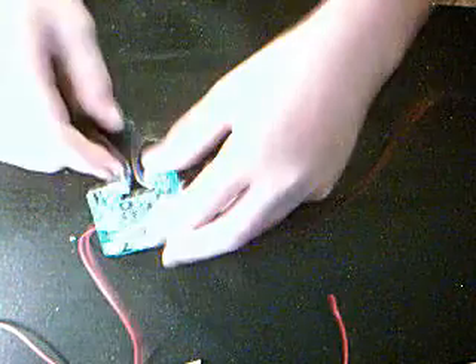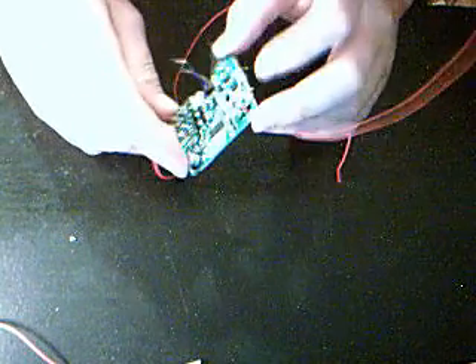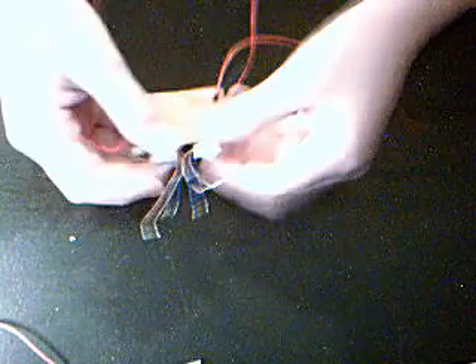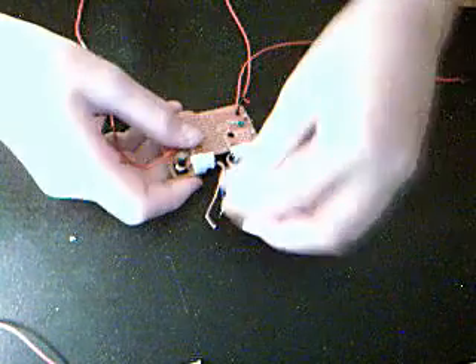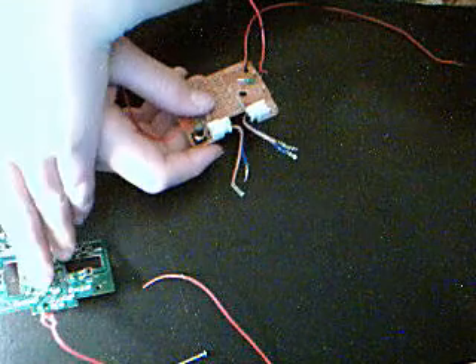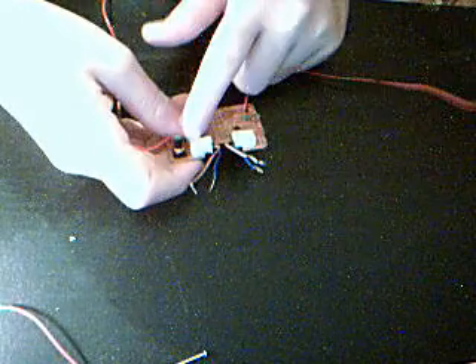This is the receiver right here — a simple board. It's got an H-bridge, some transistors, all kinds of circuitry. Here I've got my power connections right here. Now you'll find your leads here, and these leads go to the motor. If you want to have those independent switches control four relays off of these two signals — how would you do it?